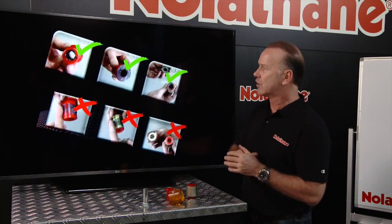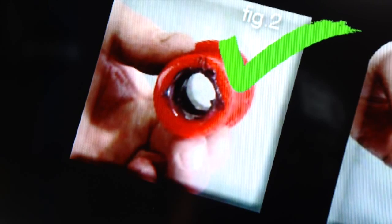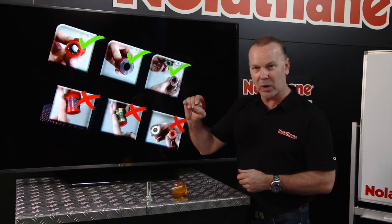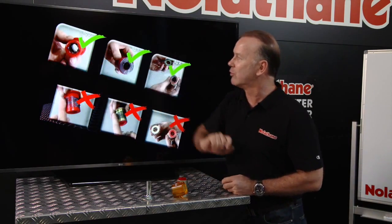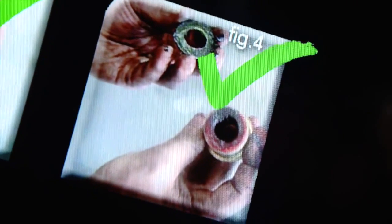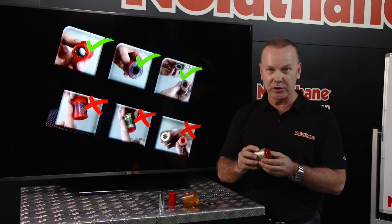So what are some of the key elements to the lubrication? Well the first thing you need to do is lubricate the working surfaces. If we grab any typical bush, I always say to people, grab it, understand how it works, understand where the clamped force is, and where the working or mating parts are. So you only lubricate the inside particularly of that type of bush. If you've got another mating surface, like this bush here, or perhaps even a washer that goes with it, you would lubricate the mating surface. Don't make the fatal flaw that so many do by not putting any lubricant on it at all and just jamming it in there. That's no good at all.